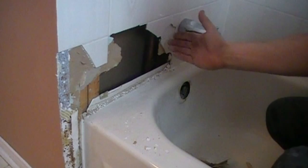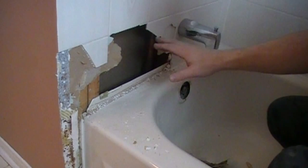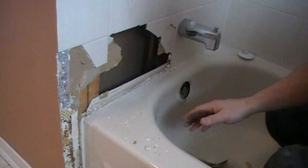You're going to need to have access to these pipes anyway, because you're going to have to do some plumbing back there. So remove the tile all the way around, remove the drywall - the fastest way is just to hit it with a hammer - and once you've done that, all you need to do is pull the tub out.